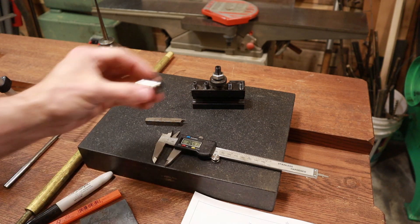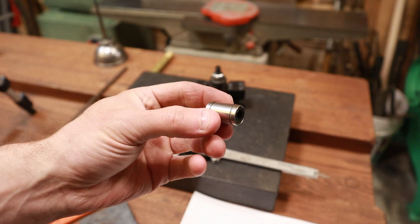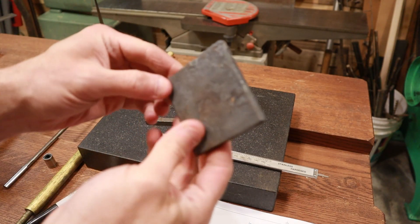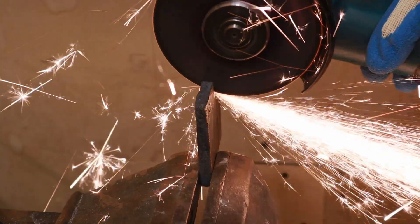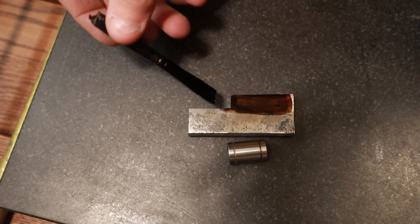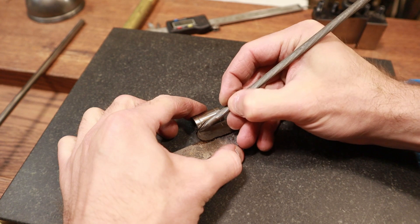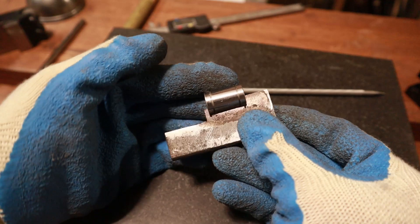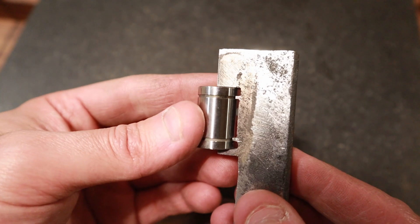I need to make seven of these replacement pieces, and probably more in the future because I may want to replace them with a plastic version. What I had in mind was to take this old piece of leaf spring — it's pretty heavy-duty stuff — and make a kind of repeatable cutting tool for this material. Brass is pretty easy to cut. You could lay this out for every single part and use a little parting tool, but I'm going to try and make this a production-style setup with this leaf spring.